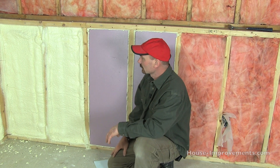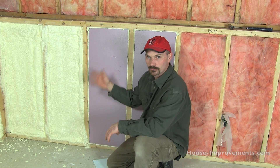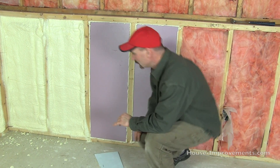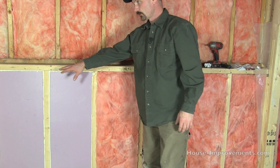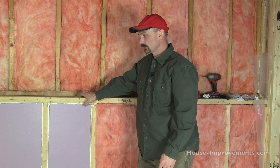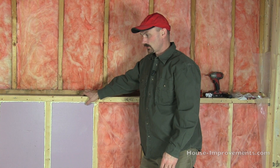Now in this case, because of the thickness, all three of these will still require a vapor barrier in some areas, so you would still need to check on that. This one here for sure does. With the styrofoams, if you can get over two inches of thickness in a lot of areas, then they'll allow you not to have to put a poly vapor barrier over top of it. So just check that all out.